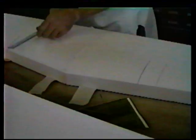Now the idea of having a 22 inch gear spread, there's two reasons for it. I want it to have the look of a ship with their landing gear further out in the wing. And also, it doesn't weaken the middle of the wing. I want to keep the middle of the wing as strong as possible. Relative to a pattern master, say, this is a relatively thin wing for a lot of rake, so I really want to have that pretty well solid in the middle.